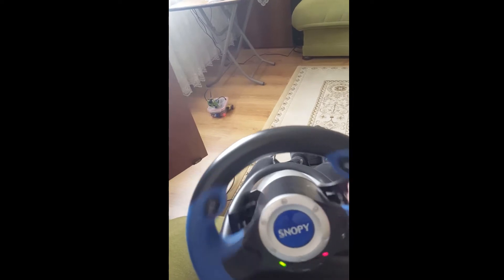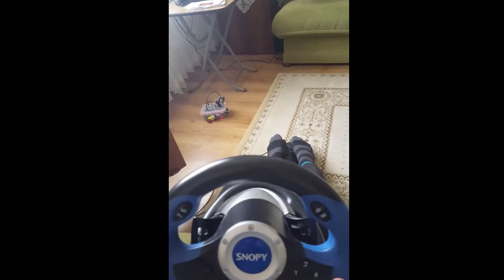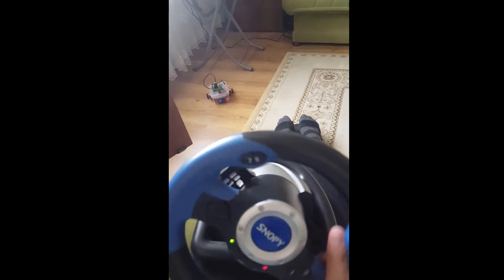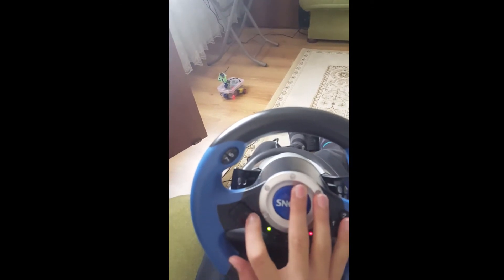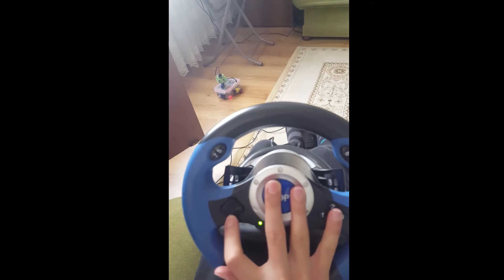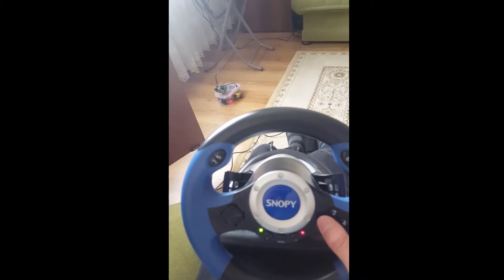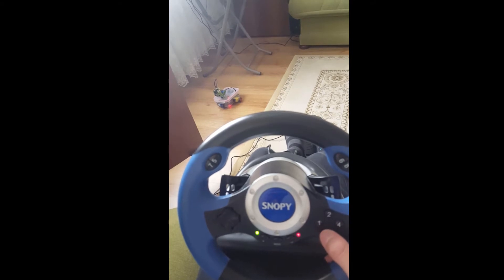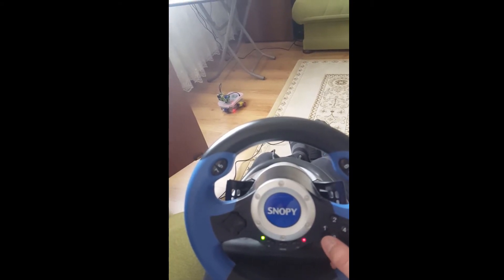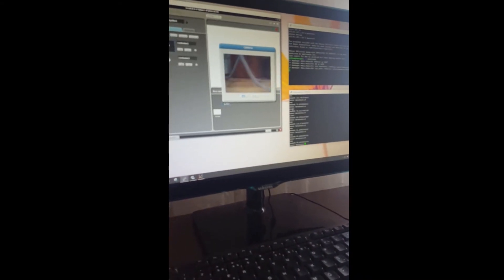As you can see in this version, I was controlling it with a steering wheel joystick. The software converts joystick inputs to keystrokes via USB, then through SSH I get raw input from the Python code to control the robot. I can control the head, turn the steering wheel, use pedals to move backward and forward. I'm also using the stream camera option as a sort of FPV feed.